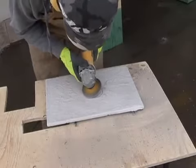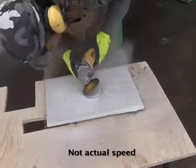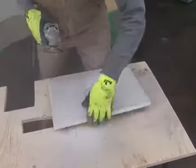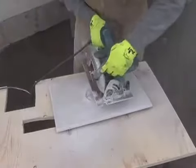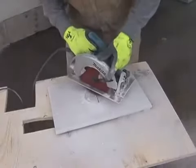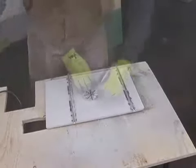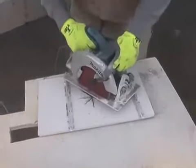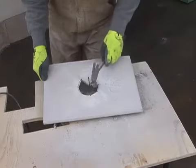For the round hole, make a deep score with the grinder. Now we cut this hole out, like cutting a pie. Finish from the back again, making sure all your cuts are long enough. Take care to not cut past the grind on the front side, however on the back side you will go past the markings as seen here.